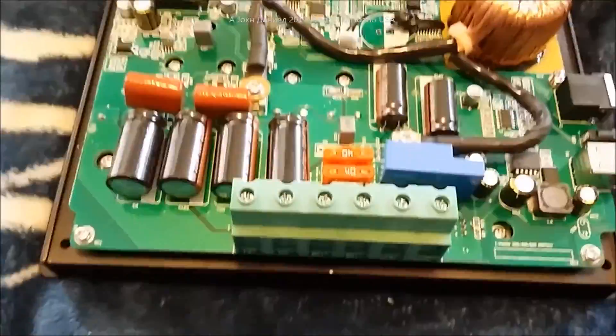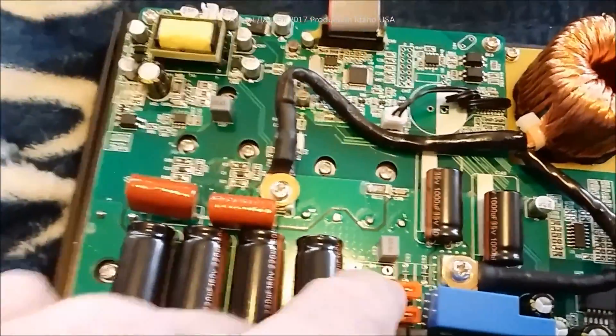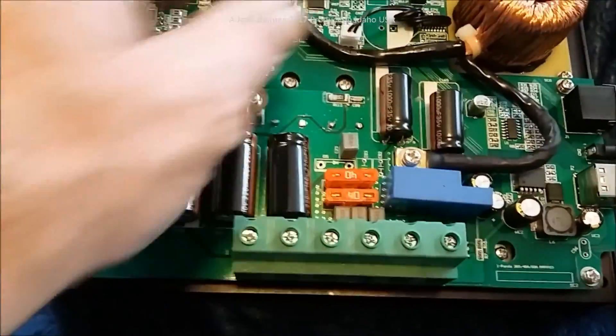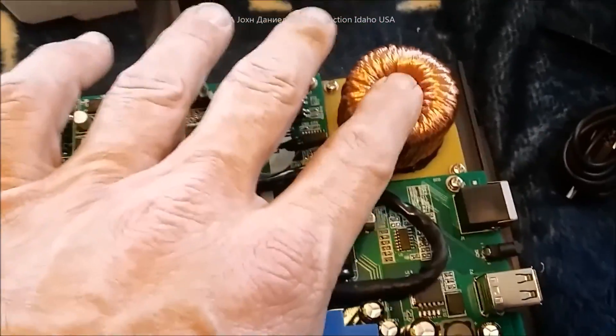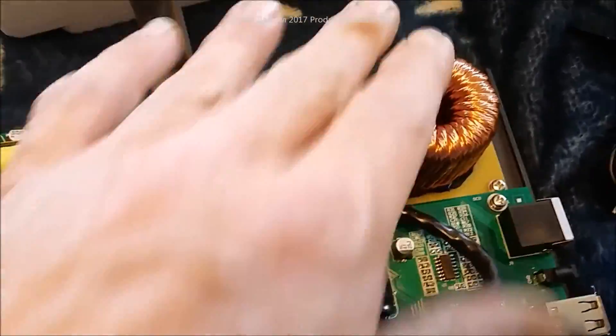There are two USB ports — from what I understand, one has a programming function and the other is for charging at four amps. Looking at the size of the lugs for mounting everything, it does have a typical in/out fuse — power in and power out — which is good; you don't find that on a lot of them. It has a relay for over-temp that will just disconnect if it overheats. It also has internal cooling that will feather the system and switch it to PWM — that is very smart. And look at this: a very, very heavy toroidal transformer — a toroid — right here. It is a solid monster.